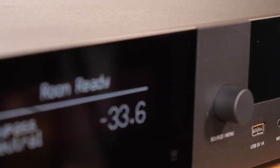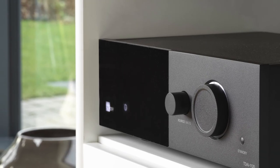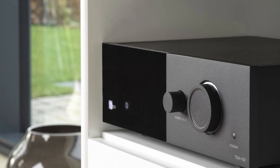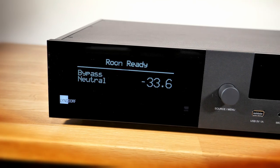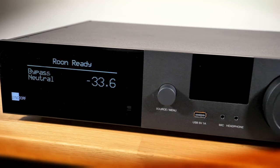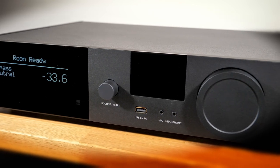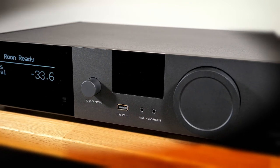The 3400 regulates volume by adjusting the current to the output stage, even being a digital amplifier. In comparison, this is done in the 1120 entirely in DSP, which means that the 3400 is always running at full digital resolution, as the internal bit resolution is never reduced or compromised for actual volume control to the output. Don't put too much into this, as the internal resolution is 40 or 48 bits, leaving tons of headroom for operating at even the lowest level possible, far away from any audible degradation.